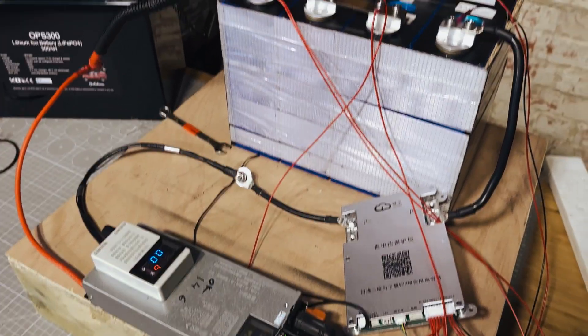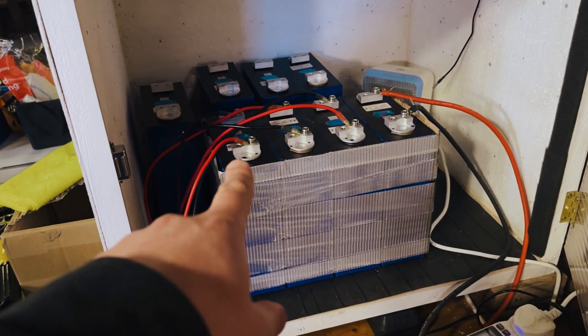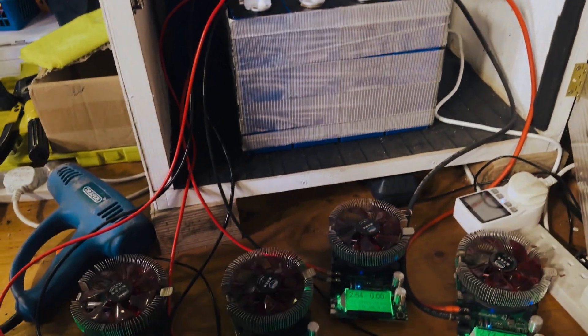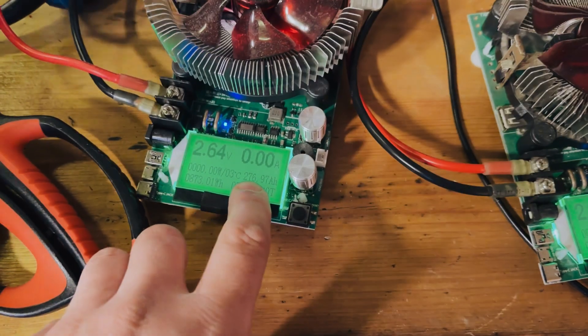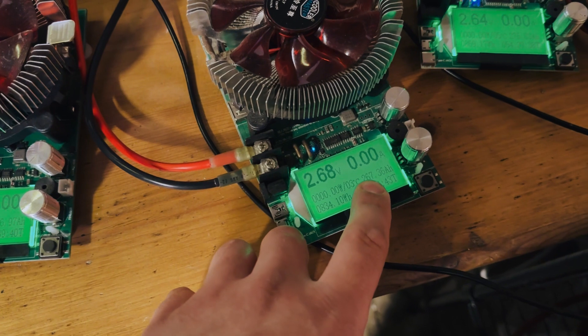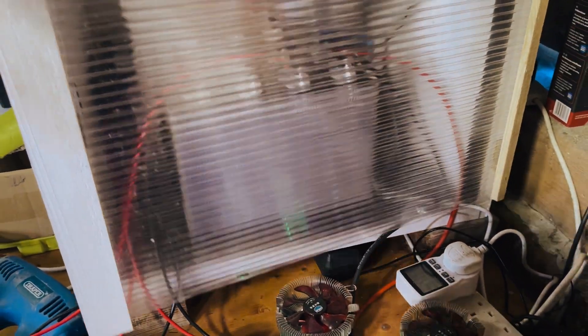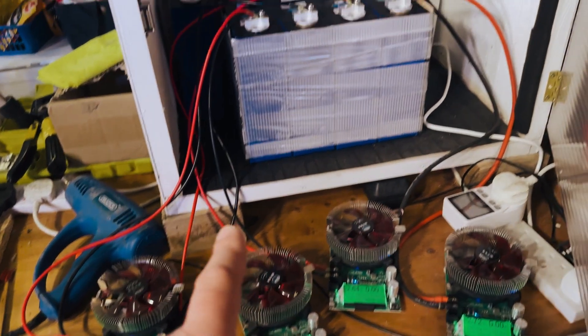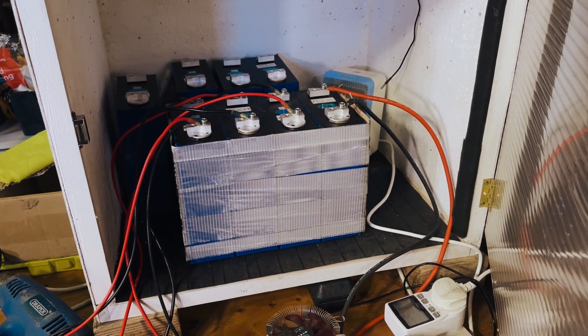Alright, this battery is now fully charged. We've put the testers on and tested each individual cell. The results for our damaged EVE 280 amp hour cells are in — they've finished running on a slow burn at just five amps draw. We got 276, 267, 276, and 277 amp hours. Not terrible considering they are 280 amp hour cells — they're just pulling just under rated capacity.